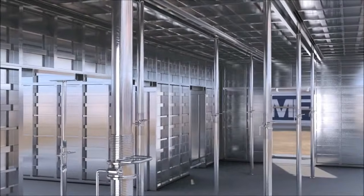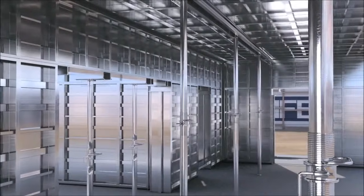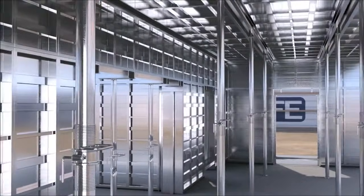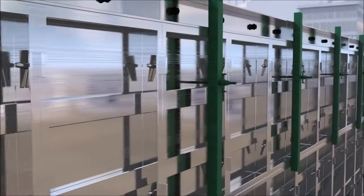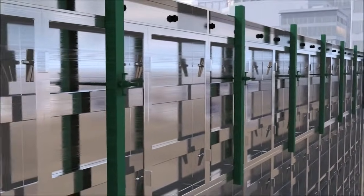While placement of the reinforcement to beams and vertical slabs, the formwork team are utilized checking the vertical alignment of the formwork and props and also the leveling of the slab soffit. This includes positioning of door spaces, vertical soldiers that controls the alignment of the kickers, providing good alignment of the wall formwork on the next level.